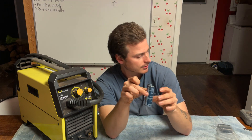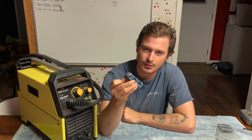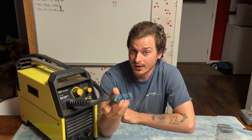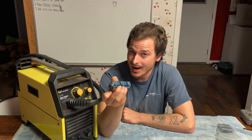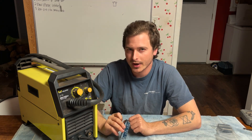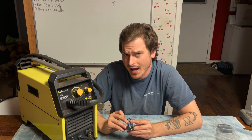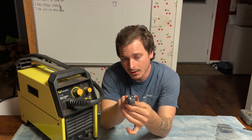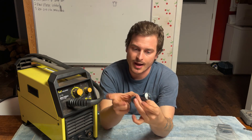Height is not that big of an issue. If you can't find the same exact height, that's fine as long as the ratings are the same. What is really important is the diameter. Especially in something like this, you're restrained to a small area, so the diameters have to be the same. When you have a different diameter, your prong spacing is going to be different, so you have to get the right diameter.